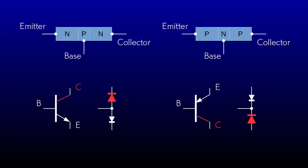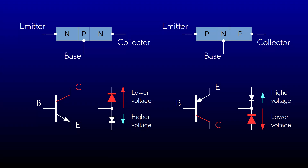Out of circuit, you can tell the emitter and collector apart because the collector diode is mechanically bigger, which means that it can allow more current to flow, which makes its forward voltage drop lower. When all three terminals are in play, the story is very different, but I'm not going there yet.